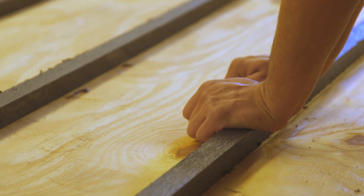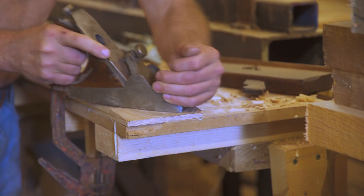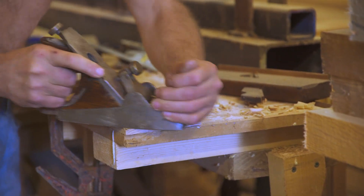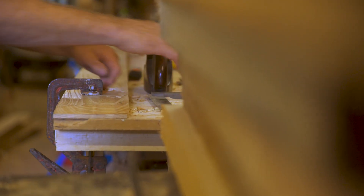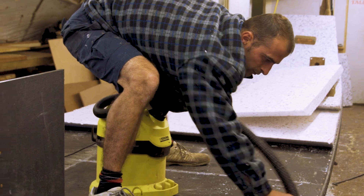I've had to Google all sorts of things to do with adhesives and melting points and polymers. It's quite hard and heavy so it will take the wear and tear, and we're having to make it as a sandwich construction with a relatively thin bottom, relatively thin inside, with a large amount of foam in between to give the whole structure its stiffness. So we've taken its flexibility and limited that weakness, if you like.